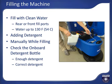Tip up the recovery tank and assure there is enough detergent in the detergent bottle. To remove and fill the detergent bottle, loosen the smaller cap and lift out the bottle. Open the larger cap to fill the detergent or clean it out. Put the recovery tank back in place after filling the detergent bottle.